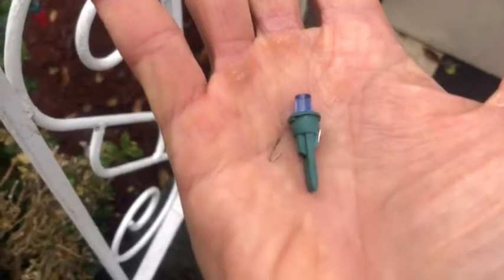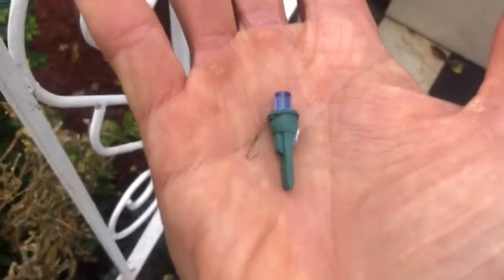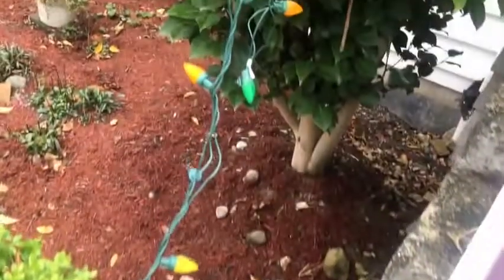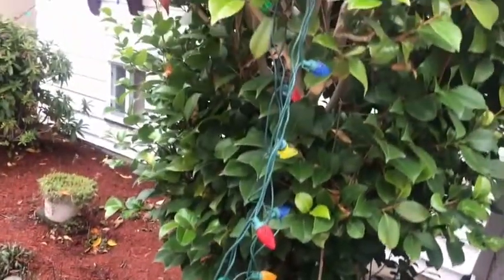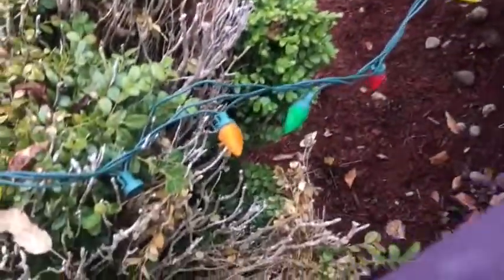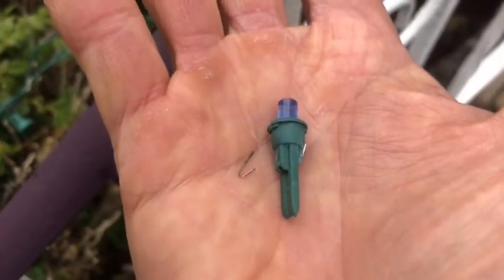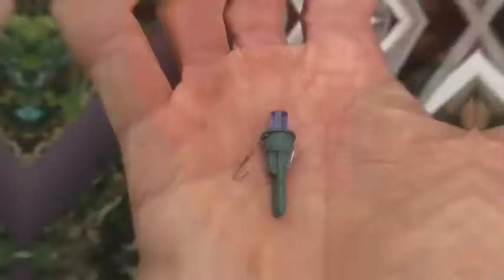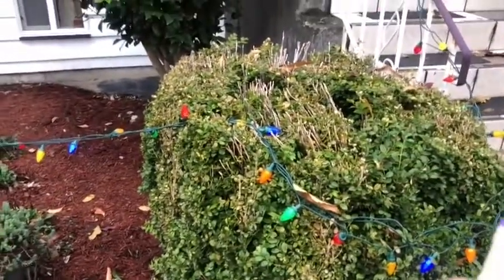Couldn't find it using the detector, so to find out which LED light is broken, I remove one at a time and check one at a time, from the last one, continuing. Then I find out this one is broken. So I will replace it. See, one of the pins, the negative pin, is broken. So one section of the LEDs is not working.